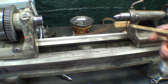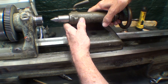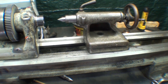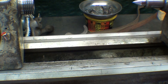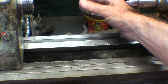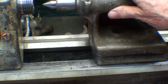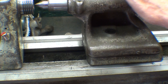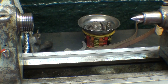Before I was so rudely interrupted, just a little oil here and right here. I've got the tailstock sitting on also right now without the clamp on it. The point I'm making here is that both the headstock and the tailstock ride on this V-way and this flat way. There is not as much wear on this V-way as there is on the outer ones because the carriage rides on them, so there would have been much more movement and much more wear. That's how the alignment is arrived at, and that's the way it's designed — a lot of thought went into that over the years.